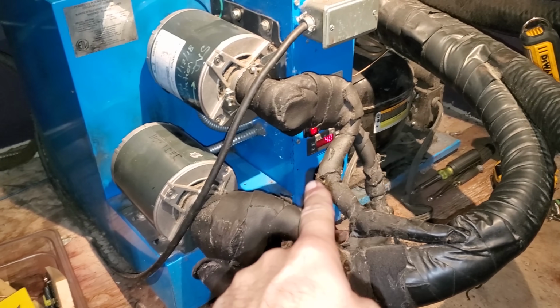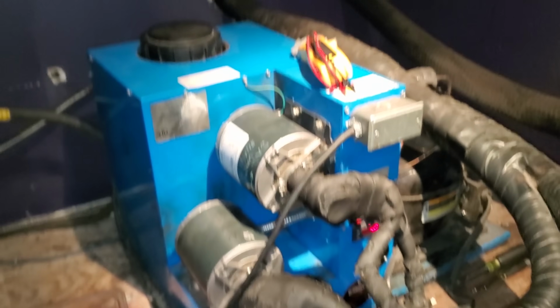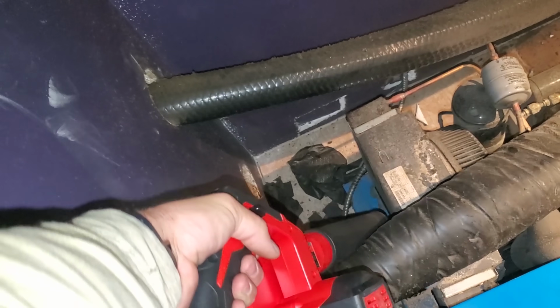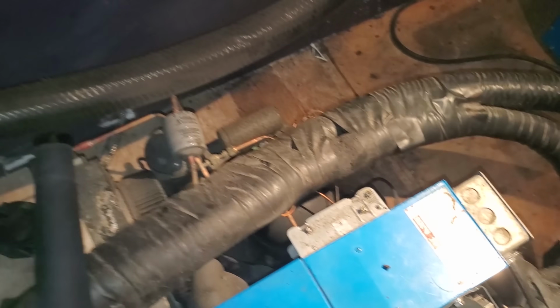That's ridiculous. All right, this thing's been running. I got the new control. It's at 40 degrees. What I'm gonna do is clean this area out really quick before customers get in the building. I'm just gonna blow it all out, blow the condensers out, because mostly it's just dust. And then that way I can work up here a little bit better. Start by clearing this thing. Not going to be happy with me because there's dust everywhere. I'm going to get yelled at, but it's got to be done.